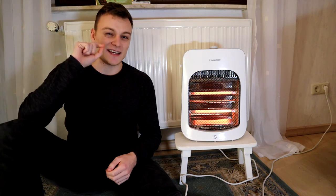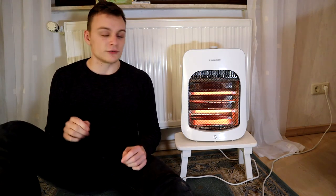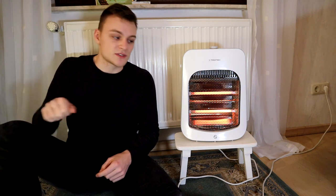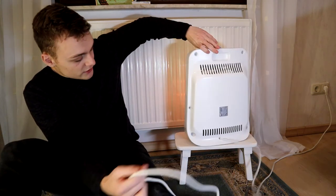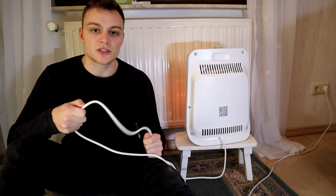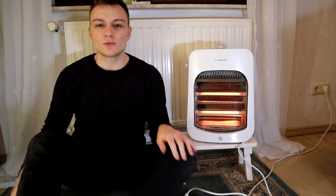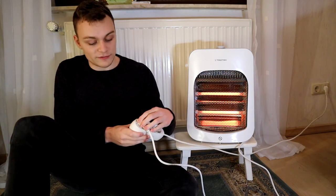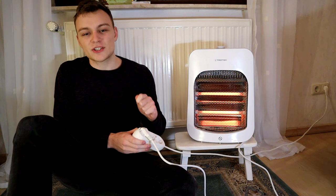To minimize the risk, you shouldn't use an extension cord at all. But if you really need one — for example, if you want to heat a room with no access to a nearby outlet — then you can get a heavy duty extension cord. Heavy duty extension cords are similar to the cords directly connected to space heaters; they are made of really thick strands of wire and can carry a much heavier load. Still, even with heavy duty cords, there can be resistance from irregularities at the connection point, so make sure you plug it in correctly.